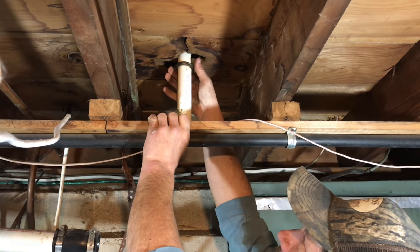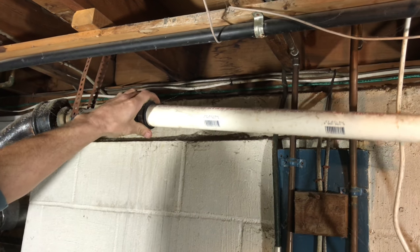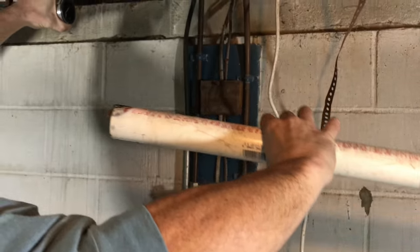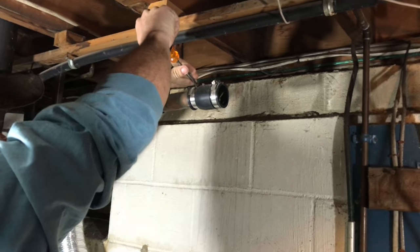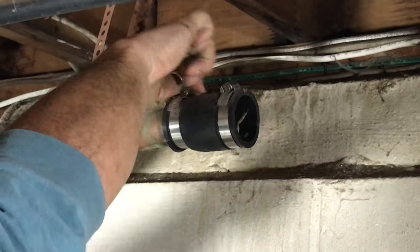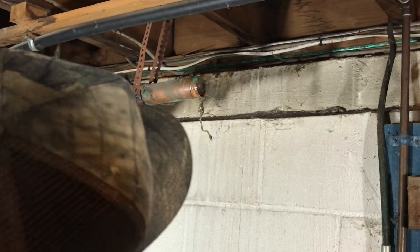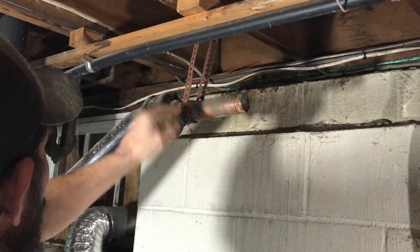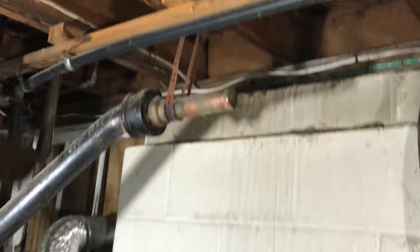We have to disconnect the other piece of pipe — those were a temporary fix made years ago. We're gonna take that pipe out and use these rubber boots because they're in good shape. It's like a nice adapter going with copper, PVC, and cast iron — like nine million different kinds of pipe here, it's disgusting. We're gonna cut here and push that back a little bit.